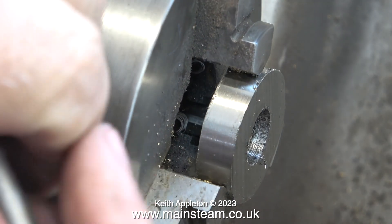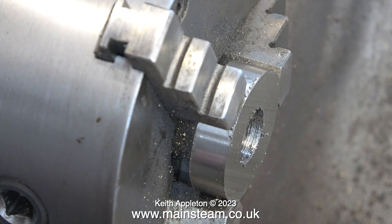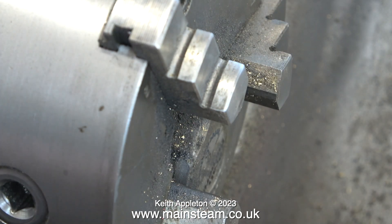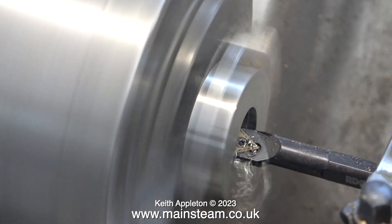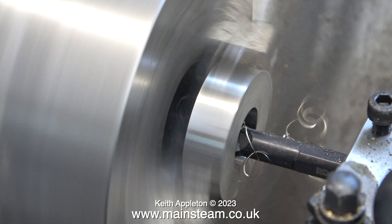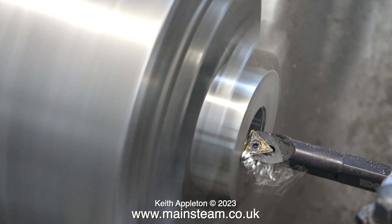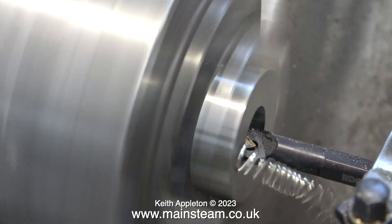At the moment these parts are not accurate — the diameter is accurate but the front and back faces aren't. I need to enlarge the center drilled hole. The first of the blanks is in position; this was the one that I faced in the lathe on the end of the bar. I'm using a small boring tool which makes a terrible noise but gets a good finish. The holes in the center of all three blanks need to be the same size, and these stainless steel parts must not be a tight fit on the safety valves or the turret.